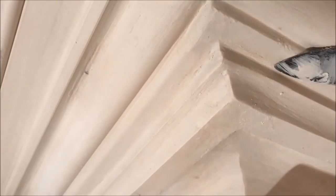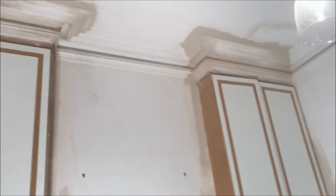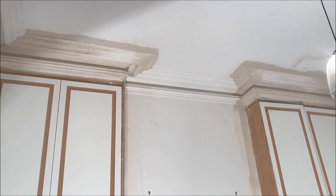Okay, we're just putting the finishing touches to it. I'm almost there with it now — it's taken a good four mixes. We've put up a two-piece cornice, joined it in the middle of the gutter, mitre side. Cut the top of the ceiling away about five to ten mil and feathered it back into existing, then joined it up to the old mitres. A bit of work down the cupboards here, patching up a bit also. The main bit was the corners — Hopkins made the corners and did a good job. It was a tight gutter and they couldn't get it on the normal way, so it wouldn't have been too hard to get out of a mould.